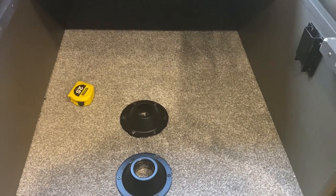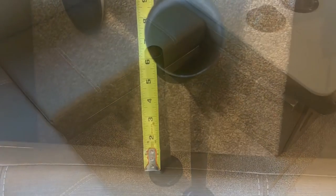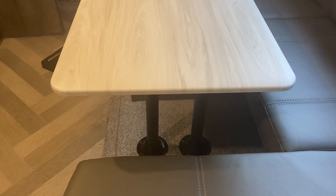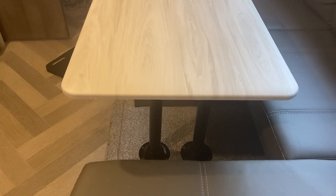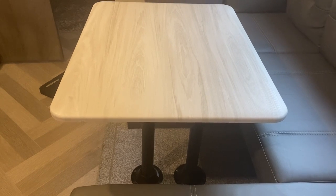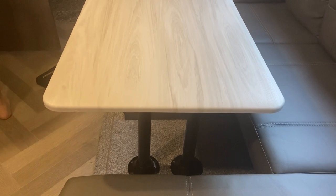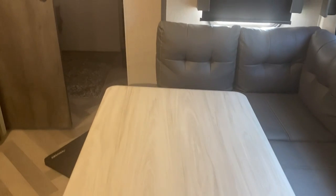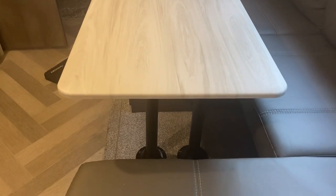Now that we've got the base in the new location, the flooring sits up a little bit higher towards the edge of the slide-out, so the table tilts back to about a half inch lower on the back side than the front. We're going to push a shim underneath the table top between it and the top cleat to account for that half inch of drop, so when you put things on the table they don't automatically roll or slide off. You can see it's a little bit more pronounced when you look across the top — there is a slight angle — so we're going to try and fix that.